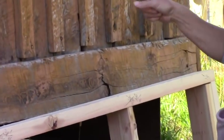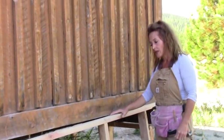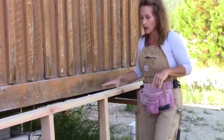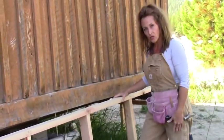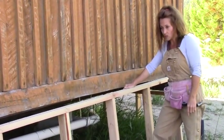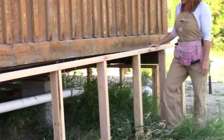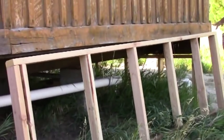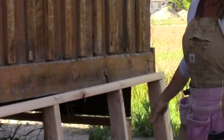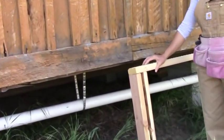This trailer on the backside of this double wide is about 50 feet long. When you're figuring out your materials list, that's going to be about five 10-foot-long frames — or you can do multiples of 12-foot frames if your dimensions are different. So five sections of ten frames is the easiest way for me to do this by myself. This is an example of a 10-foot-long frame: I have three feet at this end going to the corner of the trailer, and it slopes down to about 28 inches — two and a half feet — at the other end.